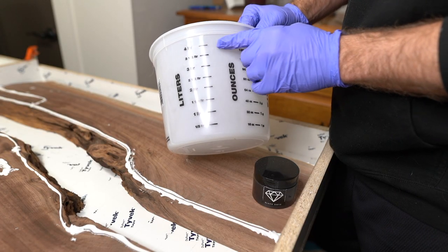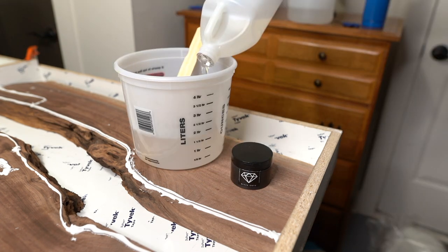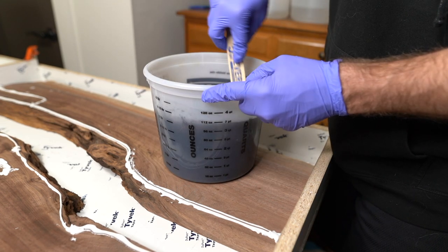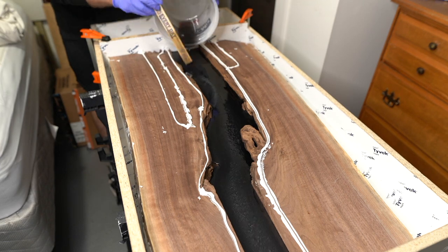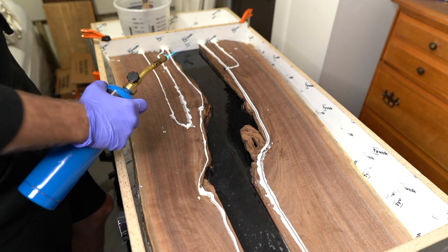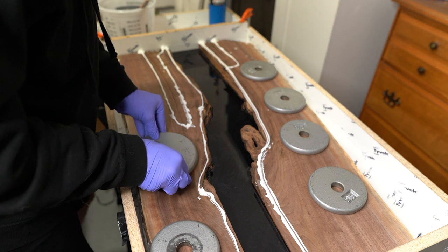For this project, I'm going to need about four liters of epoxy total based on my measurements. I was pretty accurate but just a little short — no problem adding that in at the end. I'm also using a black onyx color for the pigment. It's not a completely matte solid black, but it's also not overwhelmingly sparkly — it's got a little bit of a sparkle to it. I'm only going to pour about half right now because you don't want to do that thick of epoxy in one pour. I also ran out of epoxy, so I had to order more. We'll do our first pour and then in about 24 to 48 hours, do the second pour. I use ultra clear epoxy — they're a company in Murfreesboro, Tennessee, just south of Nashville. I'll link their stuff in the description box below.